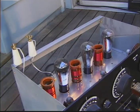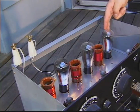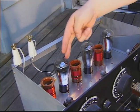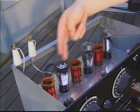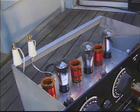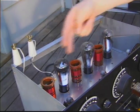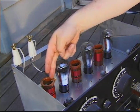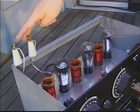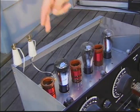A 10A crystal control unit used a 247 oscillator, a 247 buffer amp, and a 210 output. 3 plug-in coils were used in the oscillator, buffer, and output circuits. A fixed-turn magnetic coupling winding on the output coil was terminated to either the optional antenna coupling unit or 2 white porcelain cone insulators mounted on the rear brace that spanned the top of the frame.